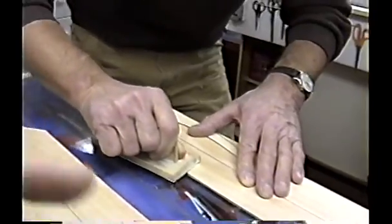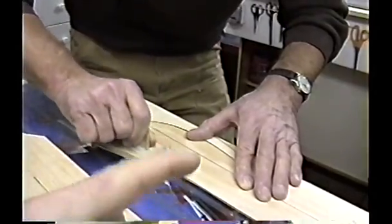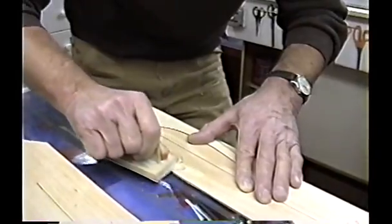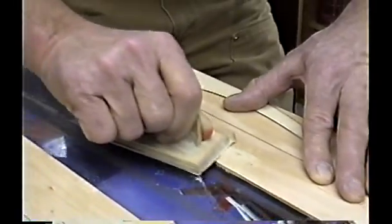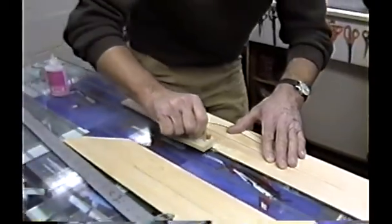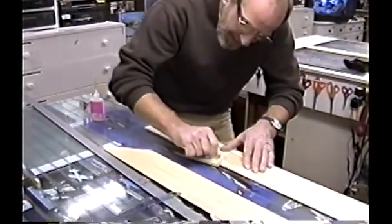What Mike is doing is getting rid of a stress riser. Whenever you have a piece of plywood end and then wood start, you want to make a nice smooth blend. Get rid of that step. Make it more like an entry ramp. Little details like this matter when you have a plane that you're anticipating 15 years of service from.